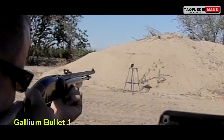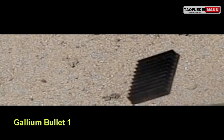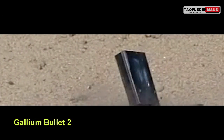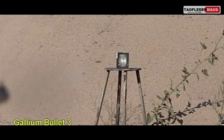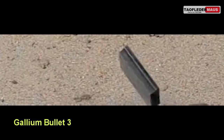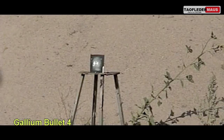Now when a bullet is fired it's going so fast that the air in front of it is being compressed — you can think of this as a piston without a cylinder. Because the bullet is traveling at such a high velocity it's actually generating some heat, and in some of these shots you can actually see a glimmer or a trail of gallium mist in the wake of the bullet. Even though we're losing some of the gallium on the way to the heat sink, enough of it is striking the aluminum and we can see it splattering as the bullets strike.